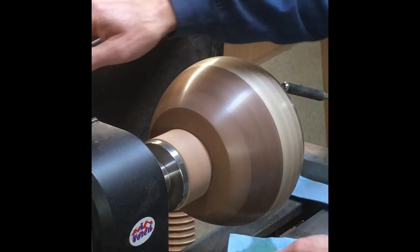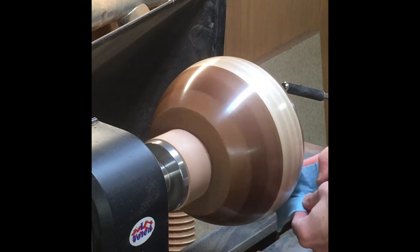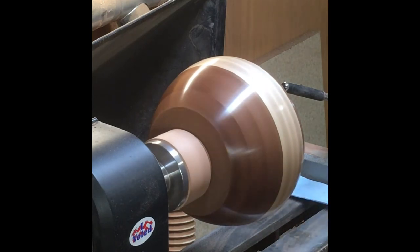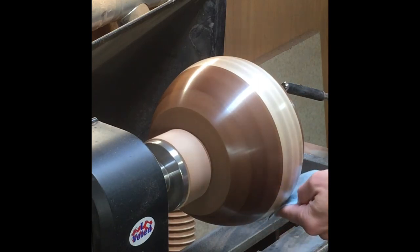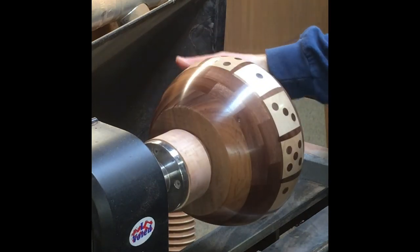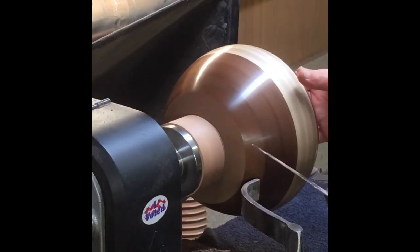In the next step the finish is applied. I have been through many different finishes, and my current favorite is a dilute shellac friction rub — one third shellac, one third alcohol, and one third boiled linseed oil. After application I'll take a fresh dry cloth and speed the lathe up as high as it will go, essentially burning it off, which gives a pretty nice finish.